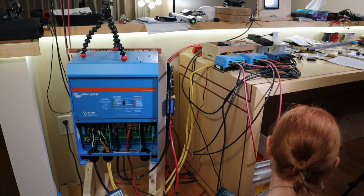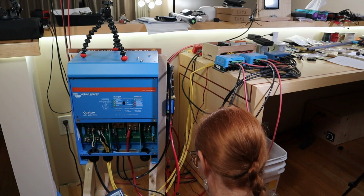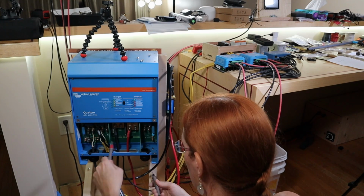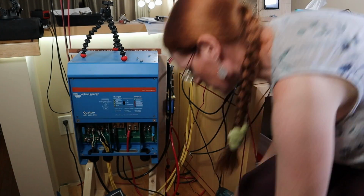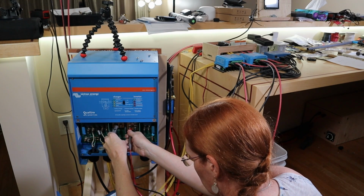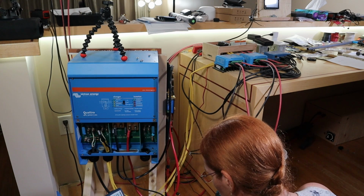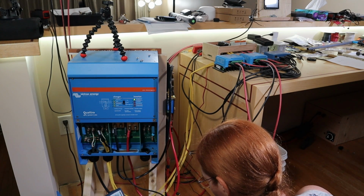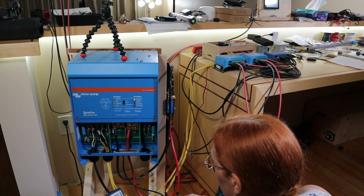39 volts, okay. Use a pre-charge resistor to bump this back up to 50-something volts. And then I will turn on the other battery. Contact. I'm not seeing an overcurrent message. Now I should have a stable 50-some volts. 52.45 and holding. On. No overcurrent message. It's fine. It's on. I got the low battery alarm, but again, I don't care about that.